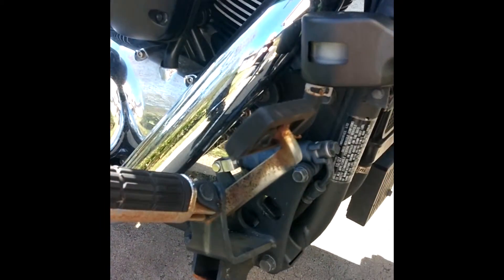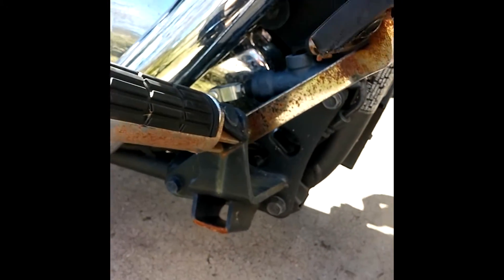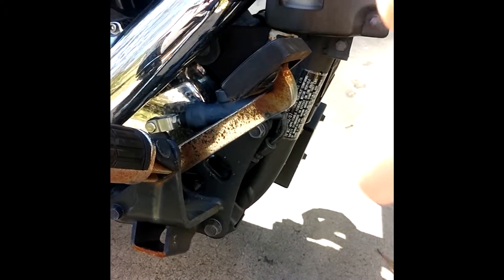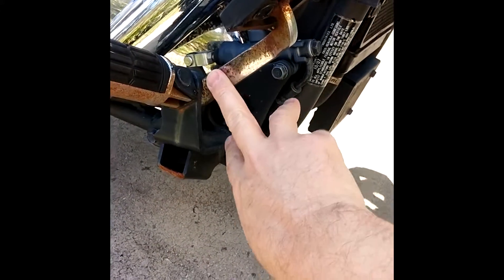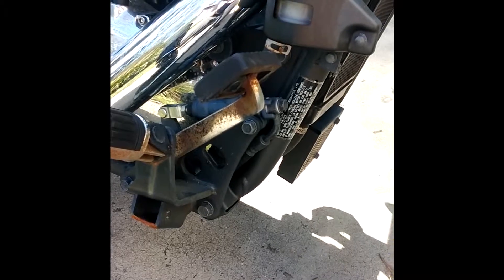Work continues. When you're done with a cleanup like this, you want to go back with some kind of metal polish to protect it. The reason you get these little spots on the chrome is because that's a hole in the chrome — maybe a stone comes up, puts a little ding, creates a little hole, and the rust comes from the metal underneath and comes out through the chrome making these nasty little spots. After you scrub the rust off, get a metal polish to seal those holes shut — that'll keep the rust from coming back, at least temporarily.